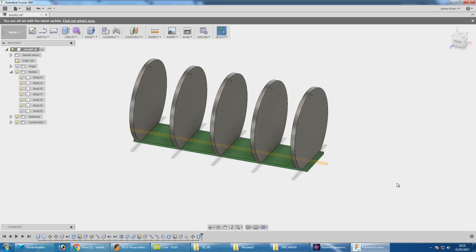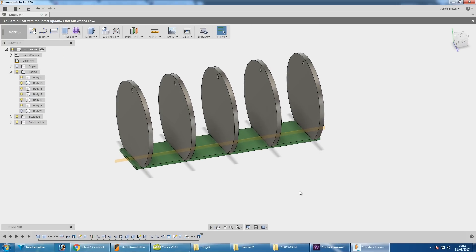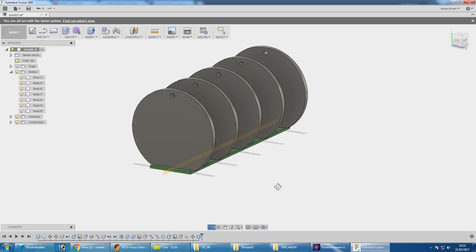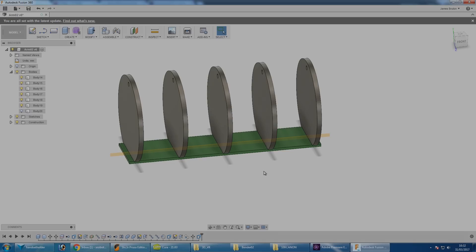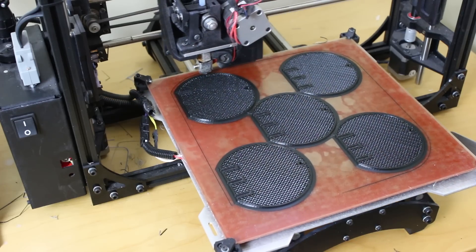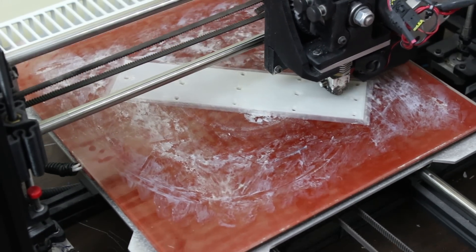Let's talk about how the arms are going to work. I really want arms that have more than one bend — not just elbows but the upper arm as well — so it'll be made of sections. The green part is going to be printed in nylon; it's fairly thin so it should be flexible. The other round pieces are going to be in ABS, screwed on the bottom. We might bend the nylon with heat to set it in a particular pose, then pull a string through the holes to cause the arm to bend. We can bend the green part in or out to make a curve and pull it whichever way we want, making an elbow and upper arm joint driven by servos. Here are some of my discs — these will be the same on the upper and lower arms.